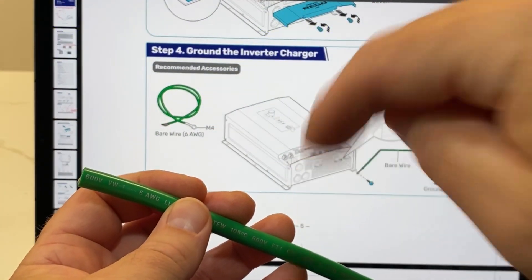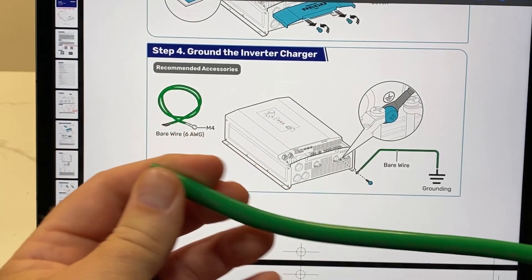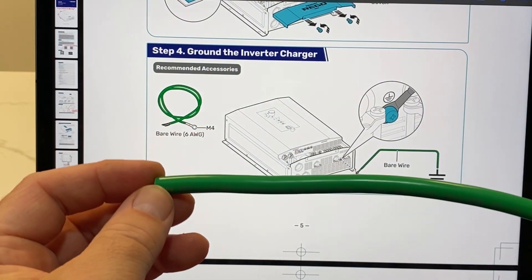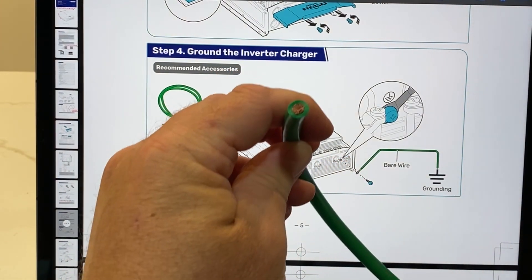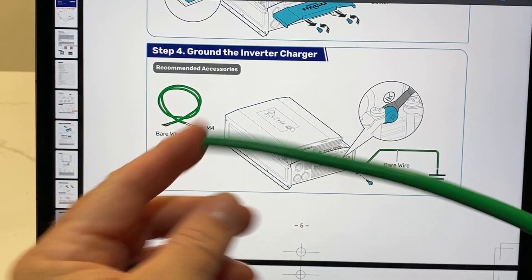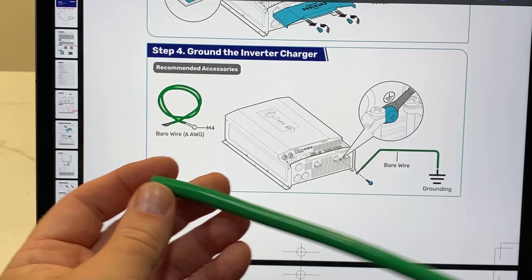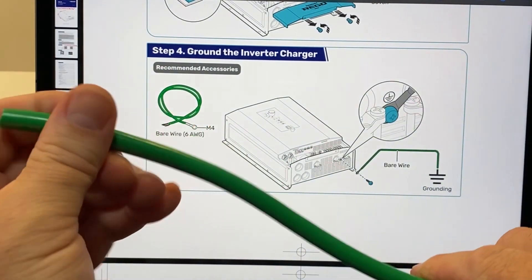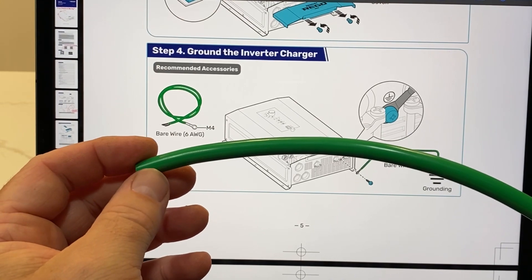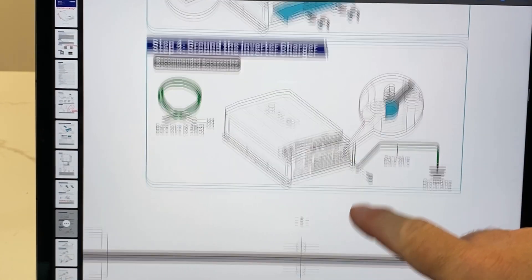I'll put a link in the description that'll take you directly to this cable in our Amazon store - I'd appreciate if you use that link to purchase it. This is incredible cable; I've used it in other applications, it's good stuff. Solid copper, not copper-clad. A copper-clad is where they take aluminum braided wire on the inside and coat it in copper, versus being solid copper - and there's a significant difference. Solid copper is much more flexible and easier to run in your lines, and it's better for long-term use.